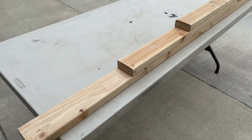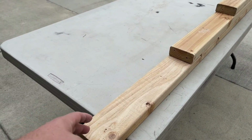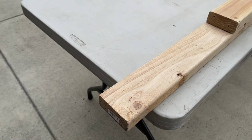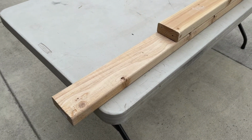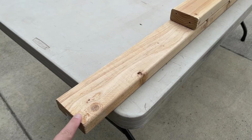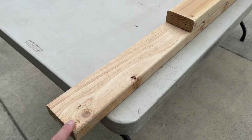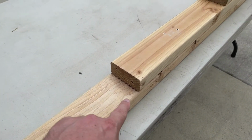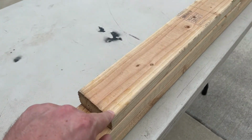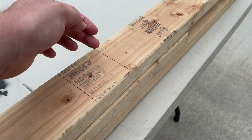Basically, this is what I think it will look like. There will be 2 of these. There's going to be one here, and then I'm going to have one over here, and basically the whole ramp will be about 10 inches wide. But this is the step up I was looking at here. First, you have this 2-inch step up, and then there's actually going to be a 3/4 inch piece of plywood on top of this. So the first step up's quite high. We're going to go 16 inches, do another step up, go another 16 inches, do another step up, and then this one is actually going to stop at 13 inches here. And then this would be the 16 inch.